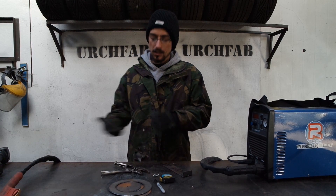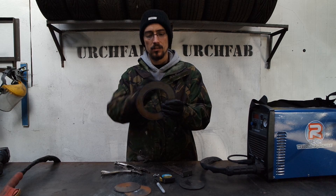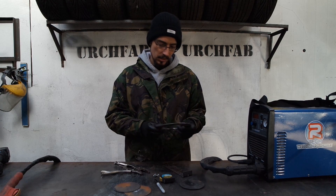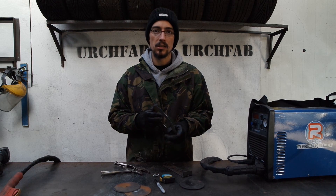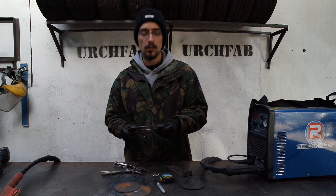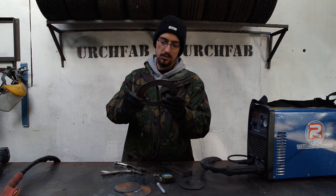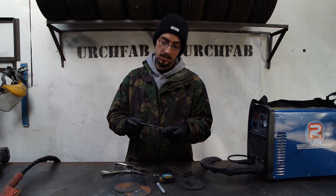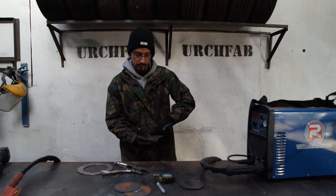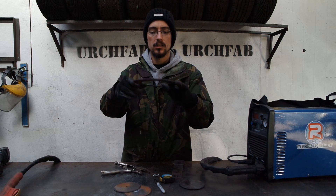All right, so that's it — how to cut yourself a circle or hoop, or any time you need a perfect curved edge for something you need to plasma cut out. It takes much less clean up when you've got a guide, something to run it along. If you're freehanding with a plasma cutter, unless you're really good at it, I find it takes so much time to clean up what you've just cut that I normally just use a grinder. This way you get a really nice finish. There's a bit of a step in it there where it slipped, but that was just where I had to move the clamp twice. If you are doing it on a big piece and you've got enough space to swing the whole way around, you're going to end up with a better finish than that. It's good enough if you're going to weld all the way around, top and bottom — that's all I would do.